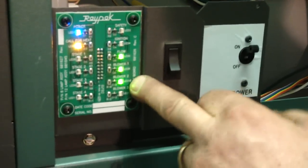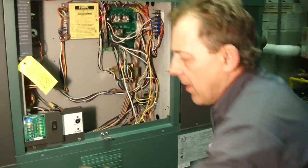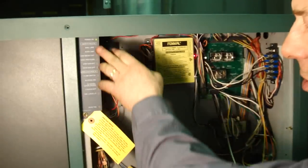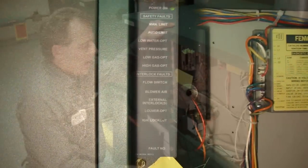We've got flow, and check if your blowers one and two are turning on. Once you're figuring out your sequence and the lights come on, the next thing you want to check is your safety pulse board to see if there's any pulse in sequence.